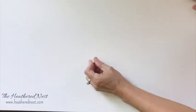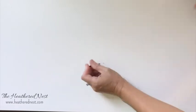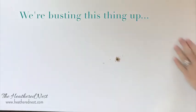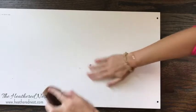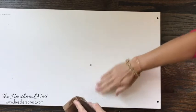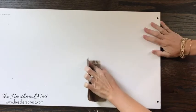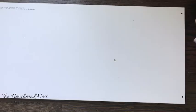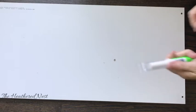We bought these shelves secondhand, but they were actually in great shape. So in order to test this product out, we intentionally created some wear and tear on the shelf. Before using the repair kit, you'll want to knock down any high spots with some very fine grit sandpaper. Be super conservative with the sandpaper if you need it, otherwise you'll really screw up the finish on the furniture.